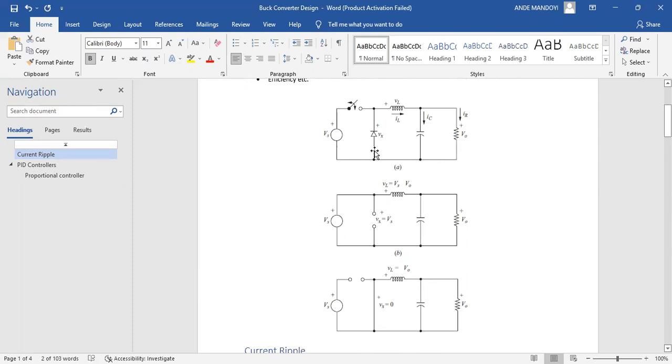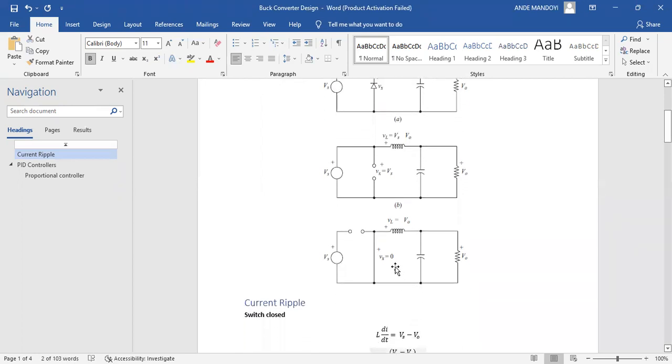And because this diode will now be forward biased. Why will it be forward biased? Because this side is more positive than this side. Forget this mistake that I made over here. This side is more positive, that side is less positive. So it's going to return through that diode path, making it forward biased, back to the inductor. So we complete our circuit in that way.